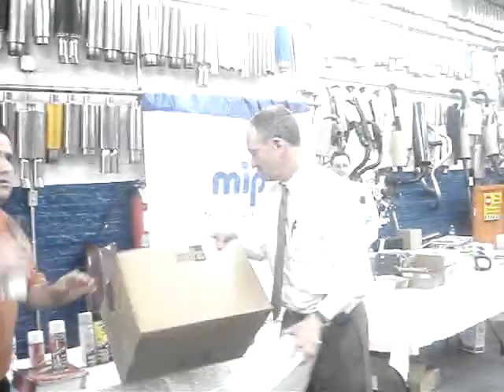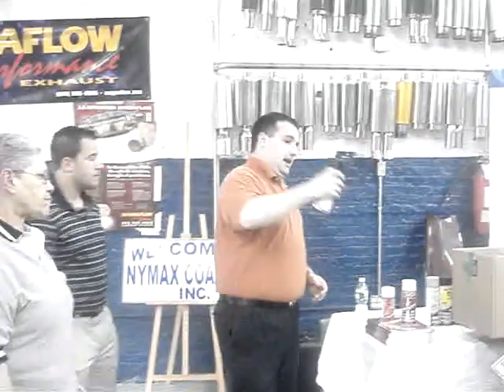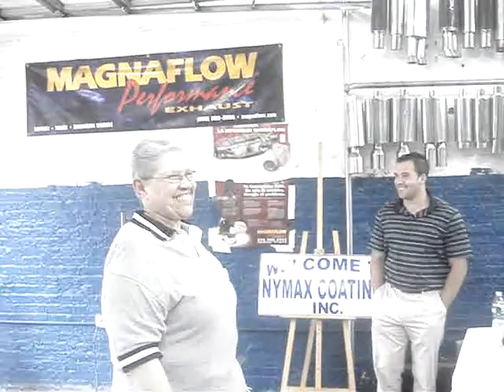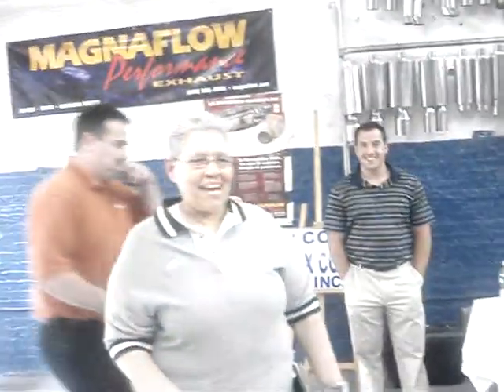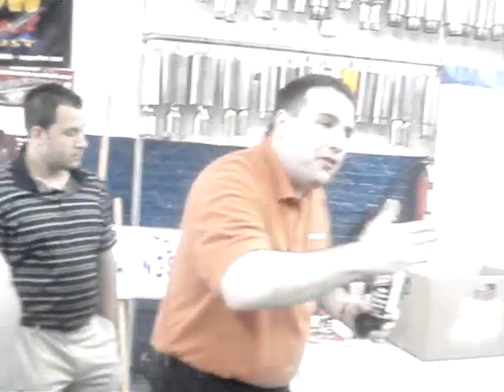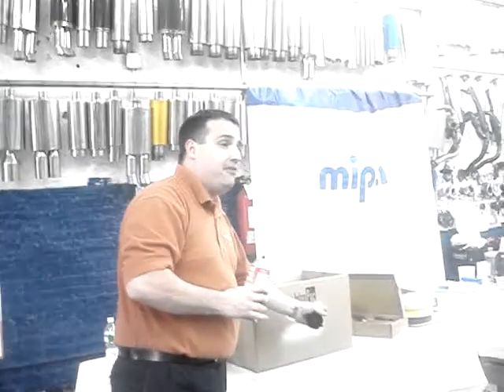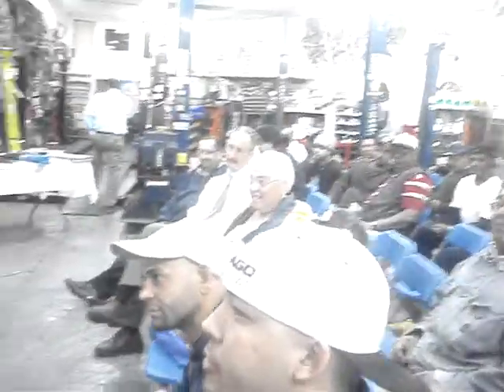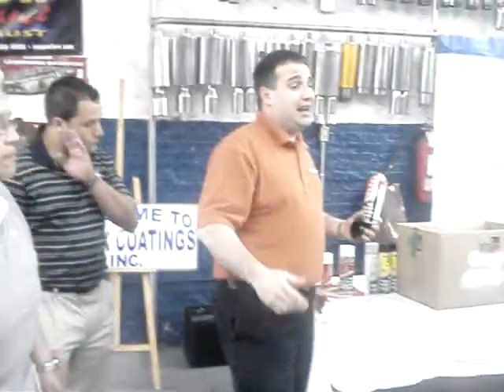Use this box for testing. You can hold it fully down but it's going to be really, really heavy. Hold it halfway down and build it up — let it dry a little, then put another coat halfway down. I tend not to hold it fully down; you get way too much material and it goes on too heavy. If you hold the nozzle half to three-quarter down, you can build up your texture. It's going to take three, four, five coats, but it's better than two full wet coats. That's what everyone tends to do — two heavy coats — and that's where you get your problems with the texture.